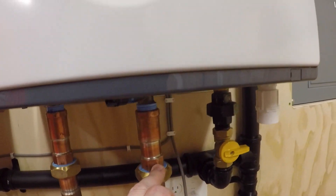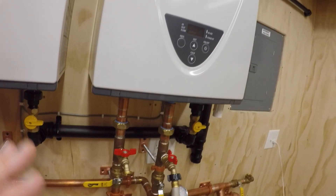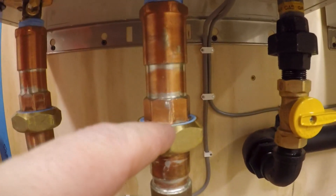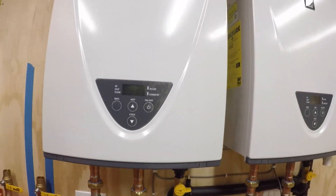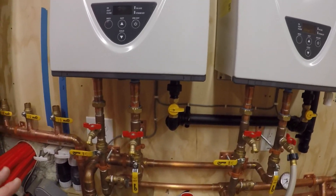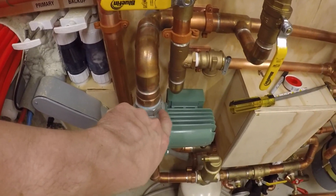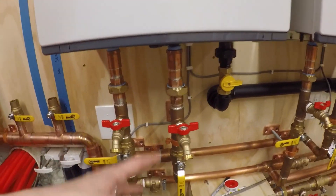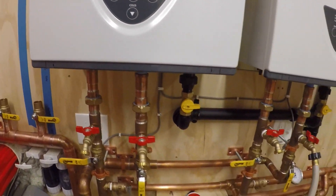I thought, okay, I'll give them the same treatment as I did down here — teflon tape and pipe dope. Went back, did all of that to them, tried it again, and I had a small leak right here coming out of this one. And on the same exact joint I had a small leak coming out of the union. So I shut it off, drained everything, tried tightening this flange another turn, put it back — still leaked like a sieve.